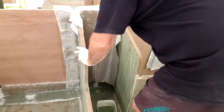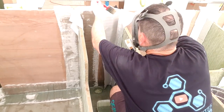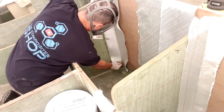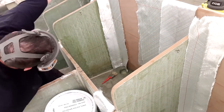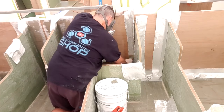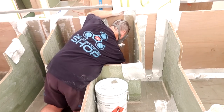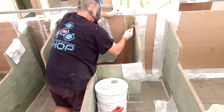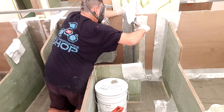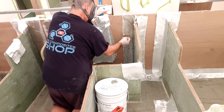It's a bit like painting a picket fence — you need to do every single surface. You cannot underestimate the amount of work involved in tabbing a section with multiple bulkheads and wing frames, going up, down and across, ensuring they're all double overlapped. You'll notice me cutting the cloth in the corners so I can get it to pleat into them. A simple cut straight up the centre for about the length of the corner itself allows you to fold it over, so in those corners you're effectively getting around eight layers of tabbing, further strengthening the result.